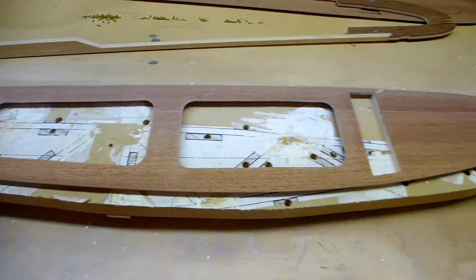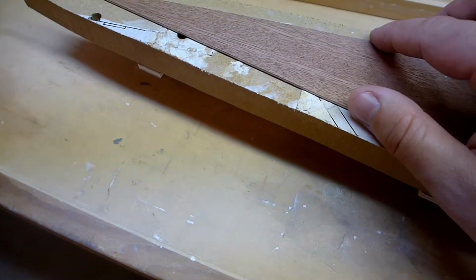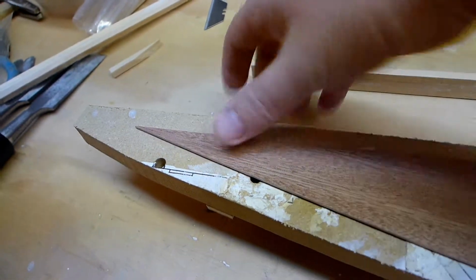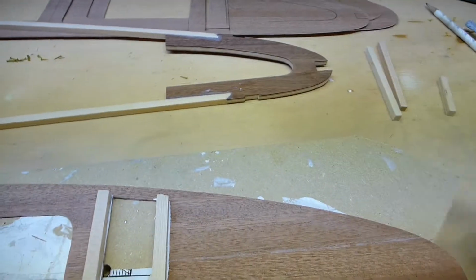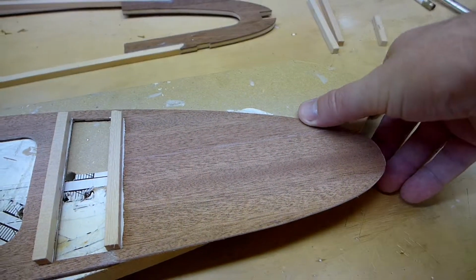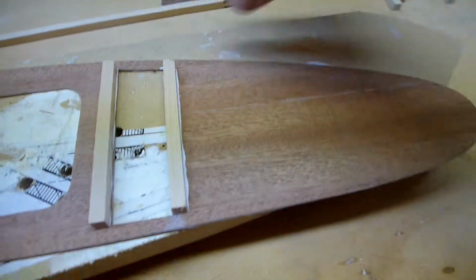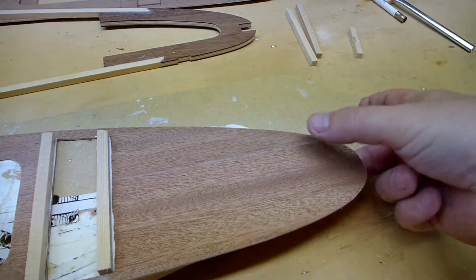When I cut this, I cut it for the rib like that. But as it turns out, what I think I can do, I'll put that close. Well, that'll need to be in the middle, I think, so the clamps can reach from this side and from this side. And they can reach up to this. In the front, you can see now how this is hanging off. The nose rib will be epoxied on there, so I can just take a clamp and put a clamp here and a clamp there, and maybe one reaching in here and over here, and then maybe one over here. It's stiff enough that hopefully having a clamp here and then one up here will hold it down firmly enough. I think that'll work okay.